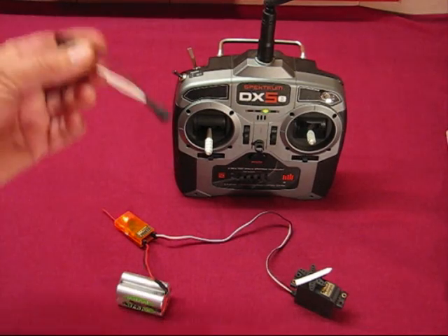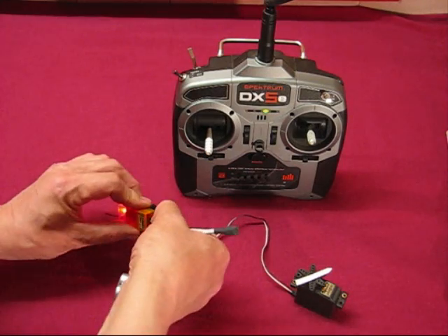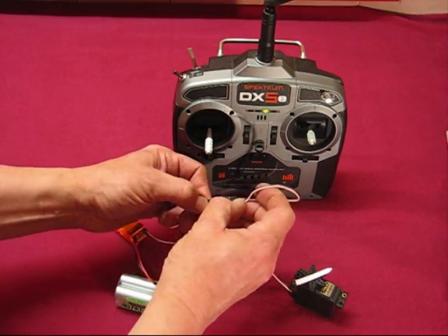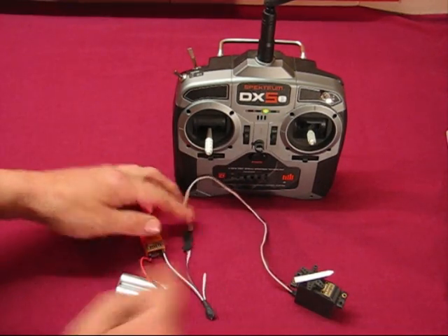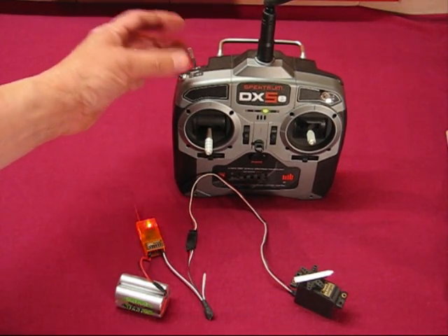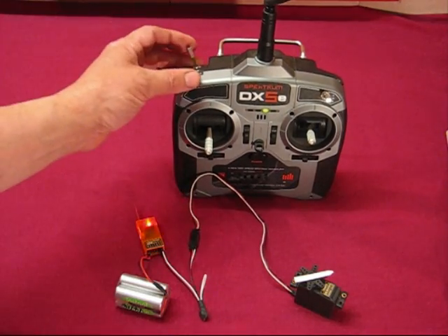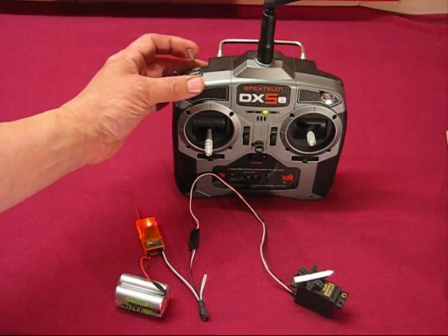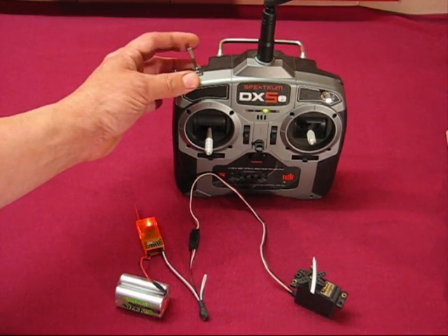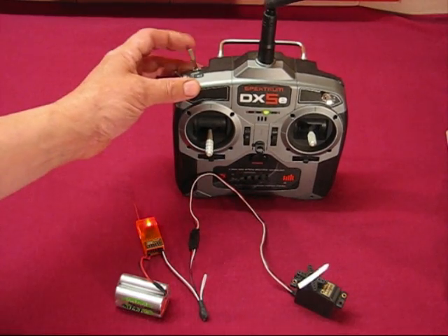There are five different versions. This one is the 8-way sequential. If I pull the servo out and stick this adapter in where the servo came from, then put the servo into the adapter, we've got it in line. Now instead of following the trainer switch as before, it moves in 25% steps: 25%, 50%, 75%, 100%, then back 75%, 50%, 25%, 0% — so that's 8 steps in a cycle.